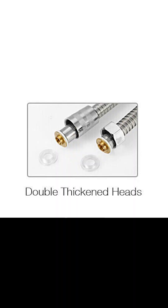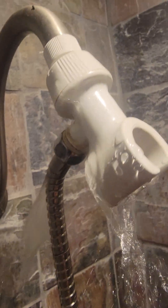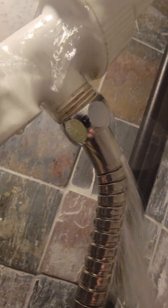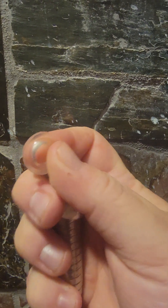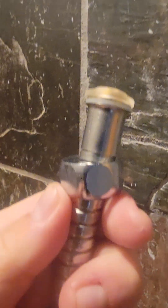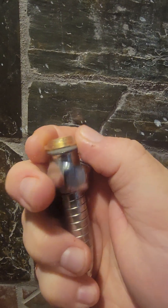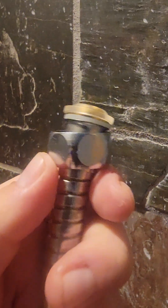And they were actually too thick — I'll just spoil it. Here's the shower, it's just leaking everywhere, but mostly out the bottom, which means the connection inside is too loose and we need to fill up that space. My boyfriend's solution was to cut off the top part of the bolt, and I said I don't want to make a physical change — there has to be another easier way. See how thick that washer is? But it's only thick in the middle, not on the sides, so it doesn't affect the threading. When you put this hose on the shower, the threads are still just too long.